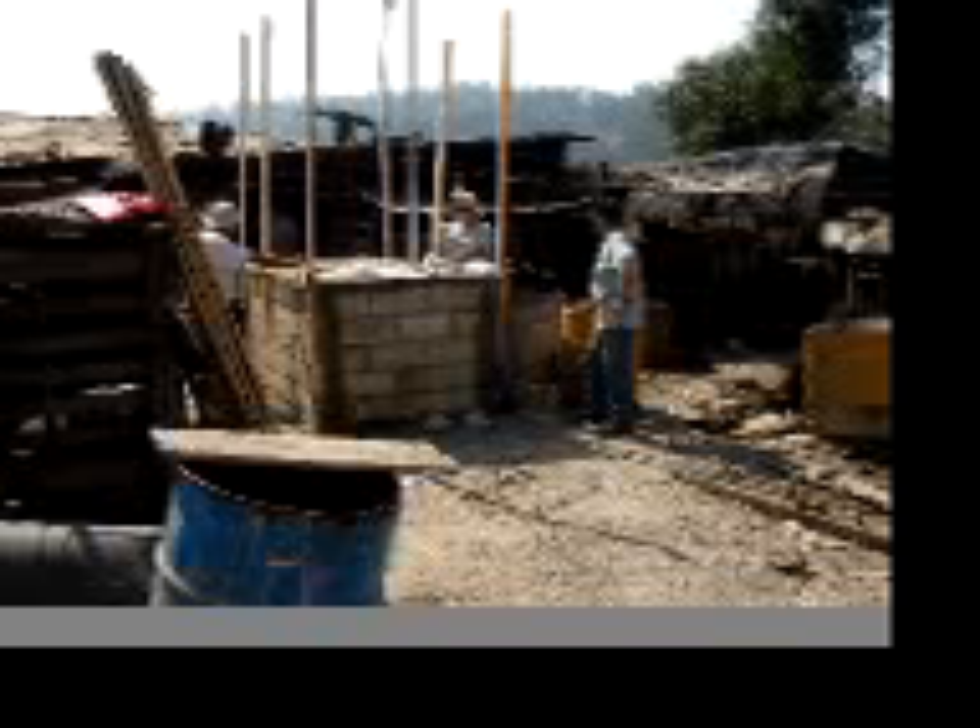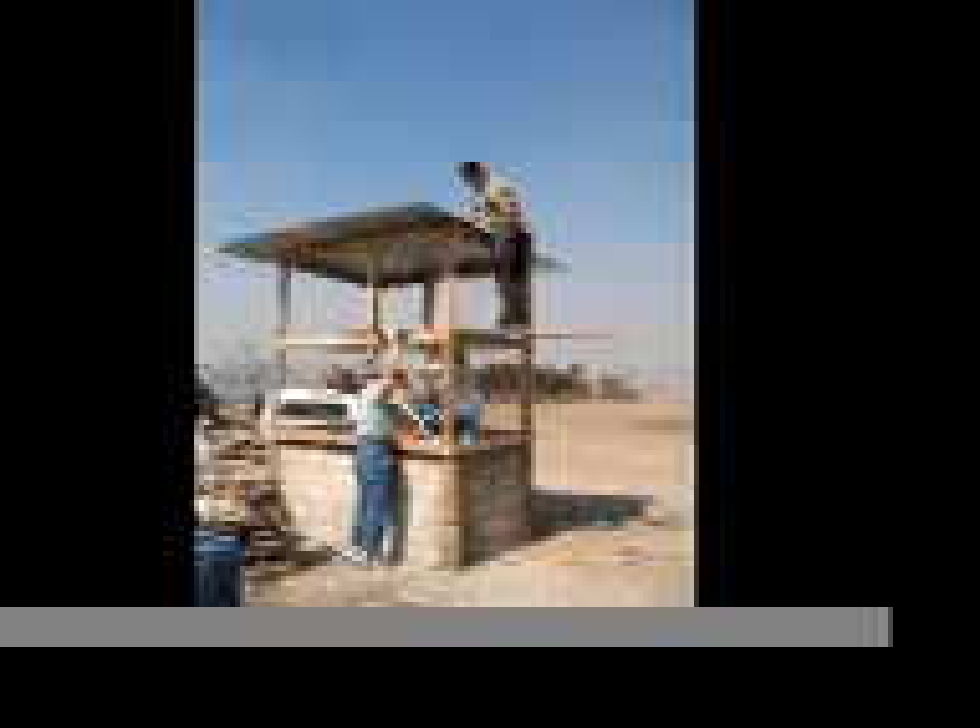The basic chambers are now completed. You can still see the holes the buckets left. The walls are framed with 2x4s and a corrugated tin roof is put on. Then, the walls of heavy tar paper are fastened on and a door frame is installed. This latrine has a place for hand washing set up outside.